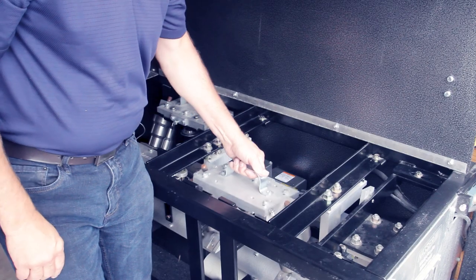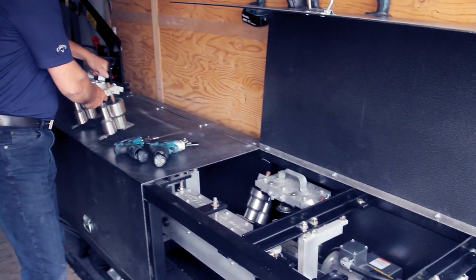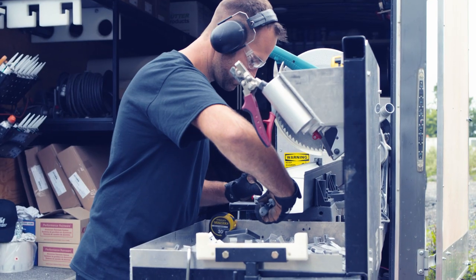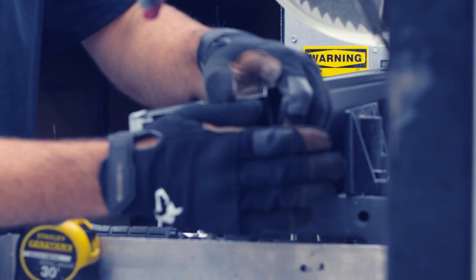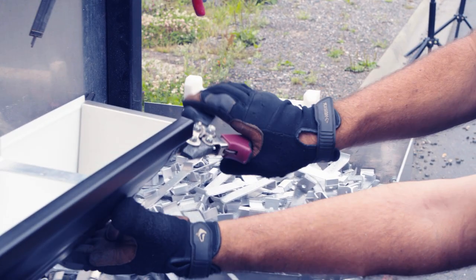One feature the Nassar MultiPro machine has is that it can run various profiles. People ask how you install end caps on different types of profiles — the answer is pretty easy. You take your flat benders and flatten the last half inch of your gutter, it slips on fairly nicely, and once you crimp it on it sits flush — you don't even see that it was crimped.